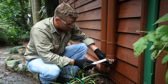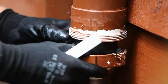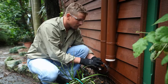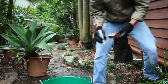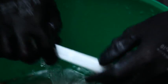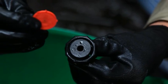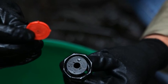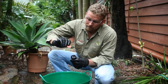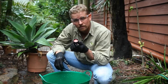Once the water's finished draining out of the first flush chamber, the bigger cap is then removed. Inside we can see the debris that the first flush chamber caught that would have ended up in your tank. We wash these parts out in water and clean the filter. On the inside of this black fitting, we have the rubber which has the hole in it, which allows the water to drain out of the first flush system after every rain event — it's important this is cleared so that the first flush chamber works efficiently. On that rubber, on one side is written 'top'. When put back together, we need to be able to read the 'top' writing to ensure that it's up the right way.